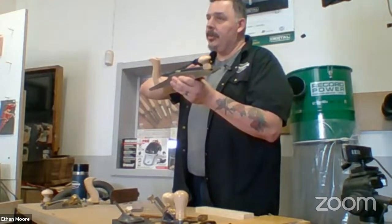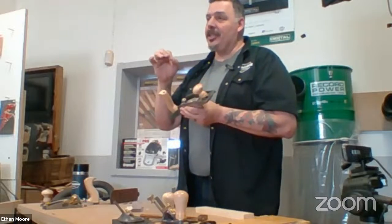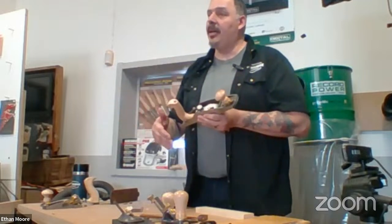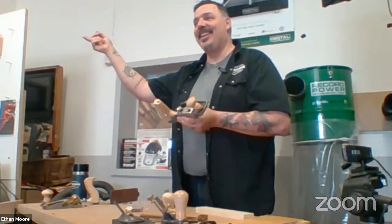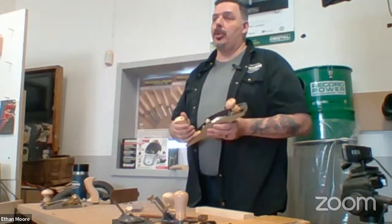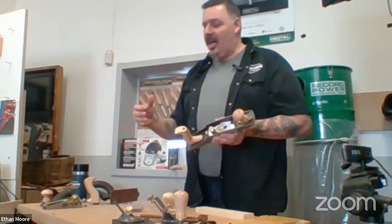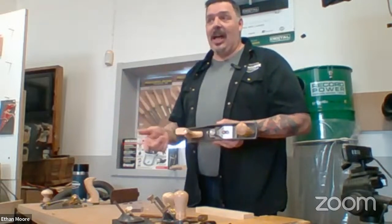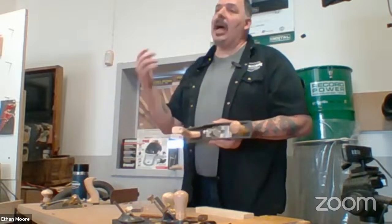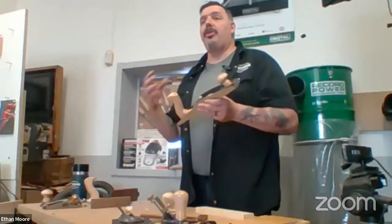It comes with a 25-degree blade — good for calm woods, good for end grain. I always try to go with the lowest blade I can. If I start to see a little bit of tear-out, then I'm going to switch to the 38-degree blade. The 38-degree bevel on top of the 12-degree bed gives us 50 — that's what the British use. That's more of an everyday angle plane. My smoother typically has a 38 in it, because I try not to work crazy woods — mostly because they're expensive and the dust may or may not actively try to kill you. I love walnut, cherry, oaks, ashes — and I typically don't need to go much further than 38 degrees.